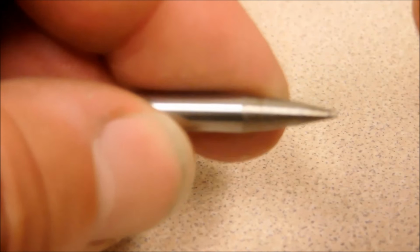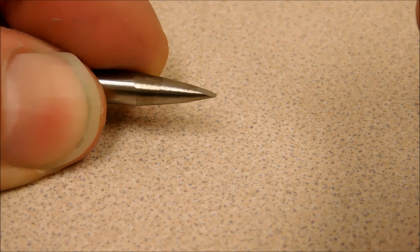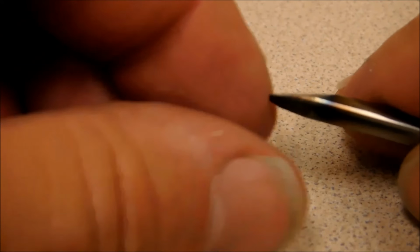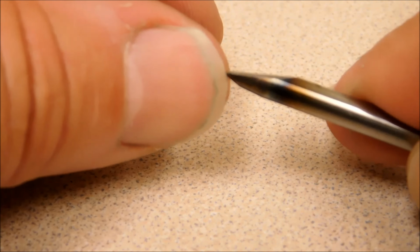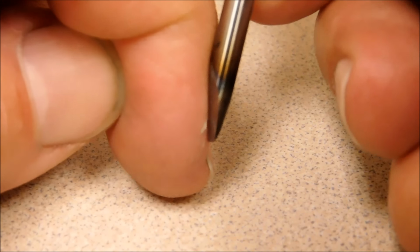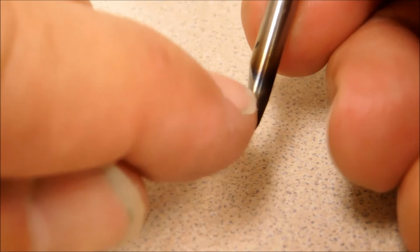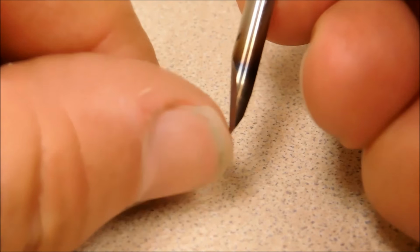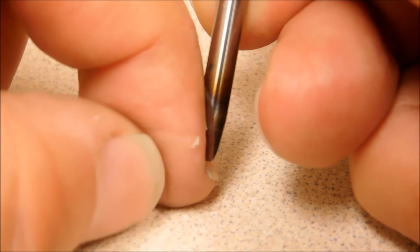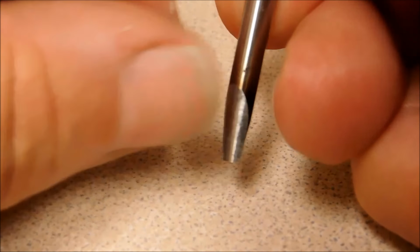And then these guys here, this is just a hardened drill blank with a small flat on one side so I can get down alongside the existing drilled hole. And this is one of my favorites right here. This is cylindrically ground on the outside with a flat tip on it, and this is ideal for walking down a hole, and if there's something hanging out it'll engage it and act like a little pick. So the cylindrical grind is for the hole in the part, and the angle is just so that it's not going straight in. It keeps it against the wall, and when you encounter whatever you encounter, if it's in the way, it's just like a little chisel, and if it's part of a thread, part of a screw remaining in there, it'll pull it out of the pitch, so it works really well.